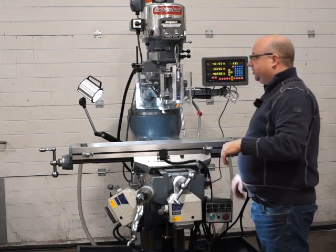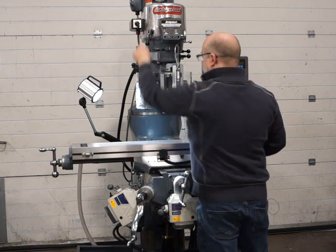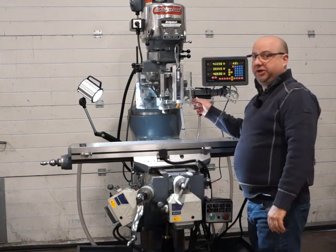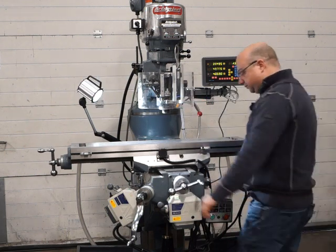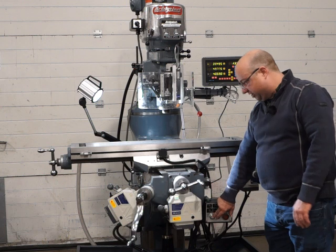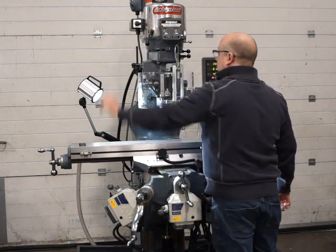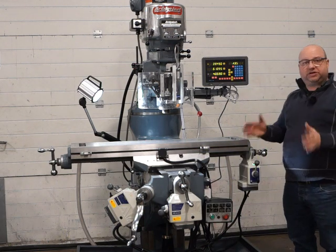Okay, so we've also got a guard in place. It's an interlock guard, of course. Firing up, we've got all the power feeds going. You open the guard, and it shuts down anything that could cause an issue. Okay, to reinitialize the guard, you just press the green, turn everything off, press the green one again, and everything fires up. Okay, so machine is absolutely beautiful.